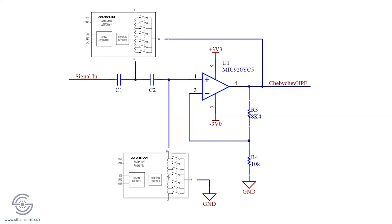The other thing that was going through my head, although I'm a lot less sure about it, is put the VDD input for any of these chips you use on something like a GPIO output, so that you actually have control over the power and can therefore do things like reset them. Yeah, well, there is the chip select line to reset these.